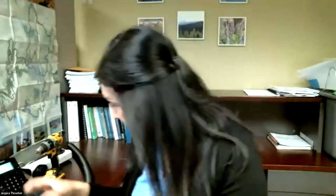Anyway, what they say is to turn it over and that you can just leave it in. But I don't recommend that, because this hole, I think, will catch ice and then it'll plug up your whole system and cause overflow of your gutter system. So don't do that. Just remove it and put on your winterization cap. Use the same 2 screws that you use for your diverter. You can see the holes right there too.